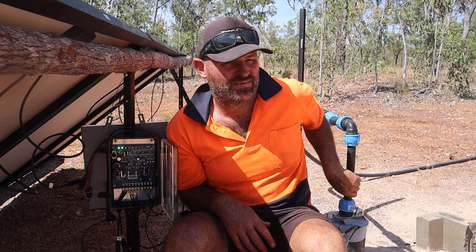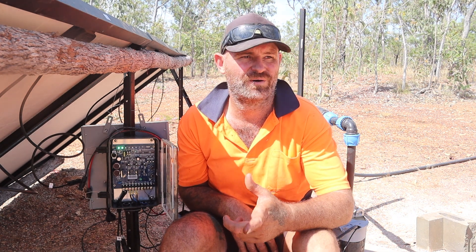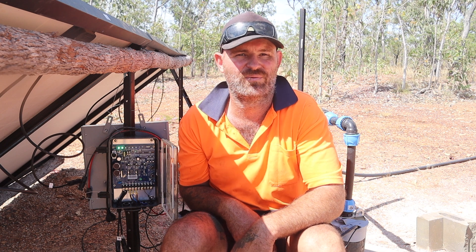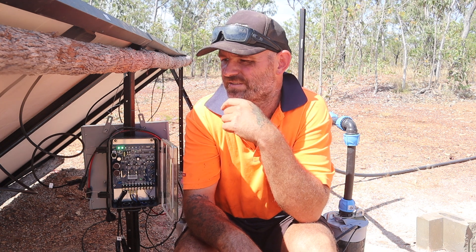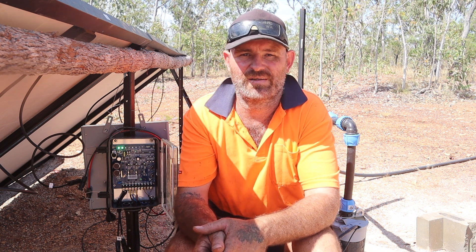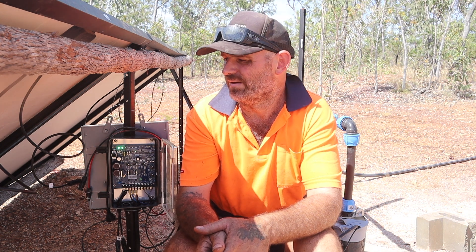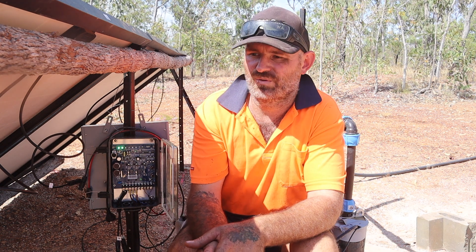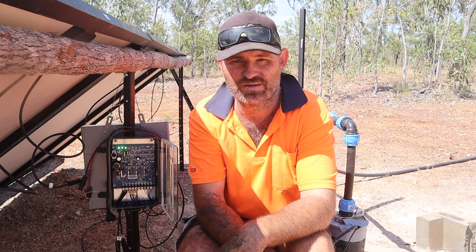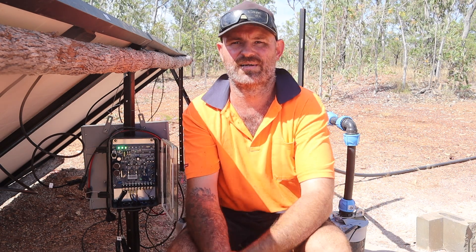It's not very spectacular, but it's currently hooked up filling up one of the tanks up the top. We've got the solar panels hooked up to the bore, running through the MPPT controller box that it comes with, and I no longer have to start the generator when we want to fill the tanks up. The solar panels themselves are 330 watts each — they are Tindo solar panels, apparently Australian made. The guy I bought them off was a solar installer who had about 10 or 12 left over, so I grabbed these four. Hooked them all together in series, checked all the specs that it was right for the pump, and it seems to work — no magic smoke escaping from the box. No generator for the water anymore. Lovely. Hope you enjoyed it. Goodbye.